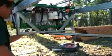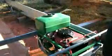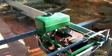Do her up. Turn that oil on. Again, use light engine oil only. Do not use chain and bar lube. There's no need for it. It's a gravity fed system. So light engine oil only. Now that you've fitted the chain up and turned the oil on, you're ready to go.